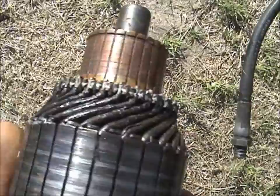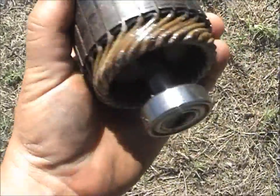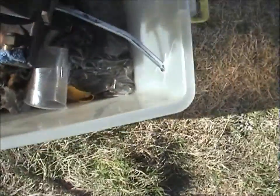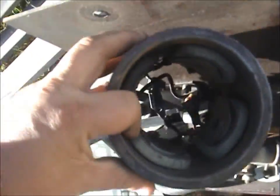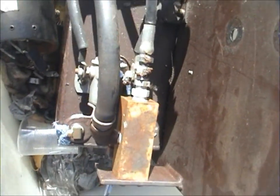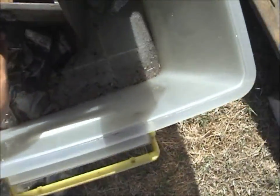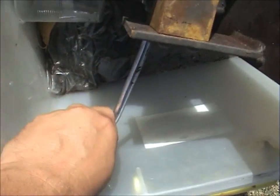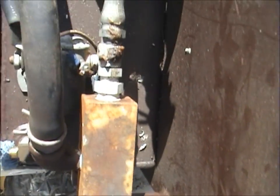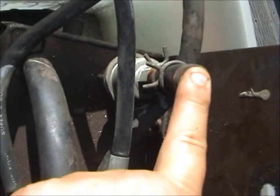It's worn to hell, rooted, done for — and it smells too. There's the carcass of the motor, brush DC. There's the actual hydraulic unit itself — your tank, your valve for lift and lower, solenoid for the motor, return filter, and there's the tiny little cute pump.